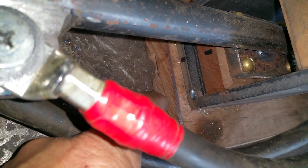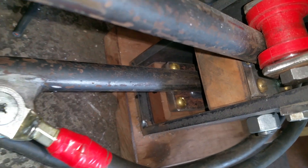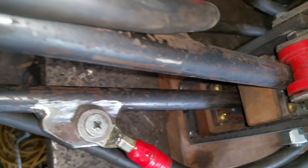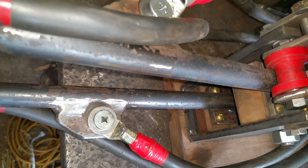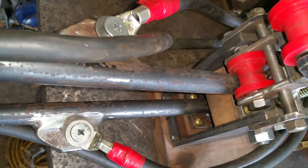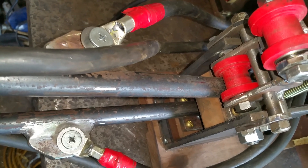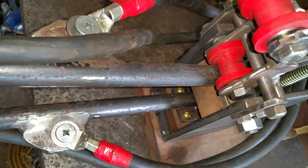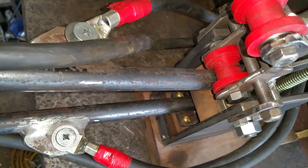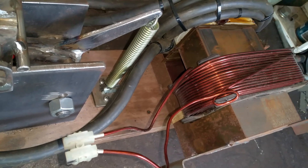The bottom arm is similarly bolted to the frame, and it's all electrically insulated. The actual frame is bolted from underneath a piece of hardwood plank, so everything is electrically insulated from each other. You're only talking about five and a half volts — less than half the voltage of a car battery. The only difference is it's AC rather than DC current, but it's not enough to kill or injure you; you can touch it while the machine's operating. The 240-volt primary side is another story — that can and will kill you.